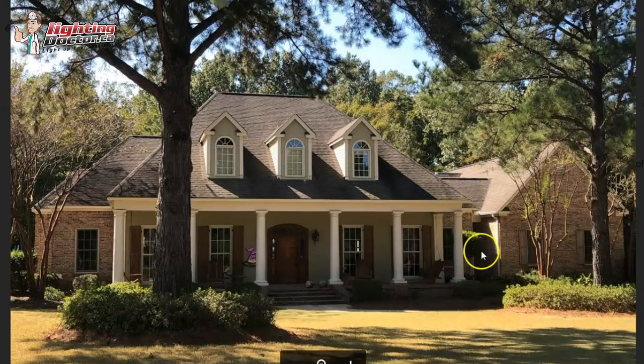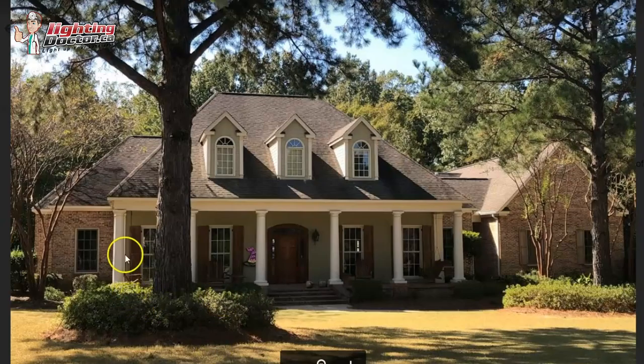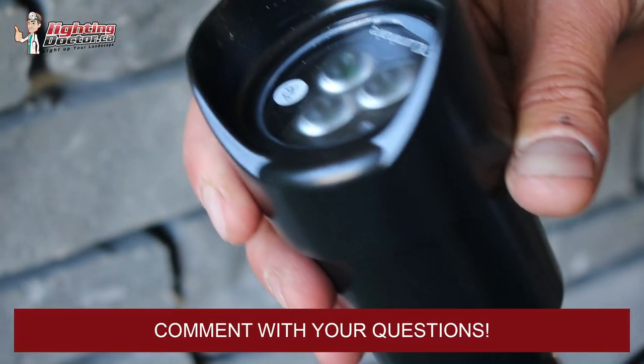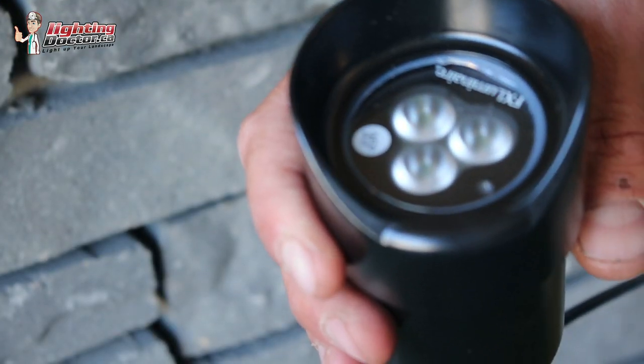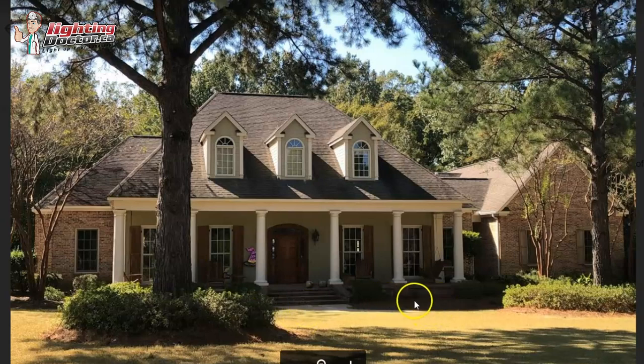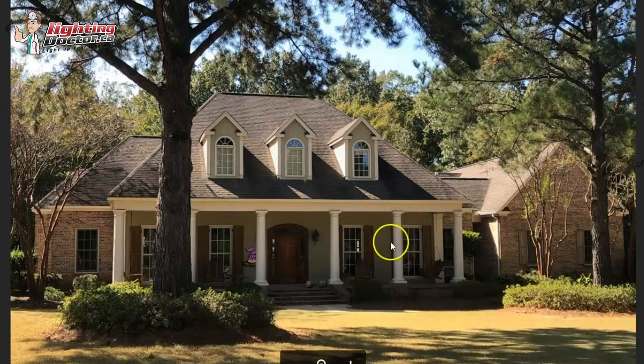First and foremost, I would definitely light the six columns you have across the front of the house — that's one of my favorite looks. It really makes those columns stand out; it's almost like a soffit lighting effect and it makes that entryway so welcoming and inviting. I'd use a standard up light because I can play with the angle a little bit more. You really just need the top half sticking out. Have six of those about 12 to 18 inches back, shining fairly upright to get that effect.